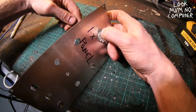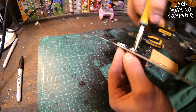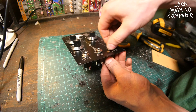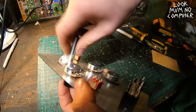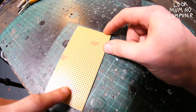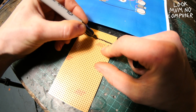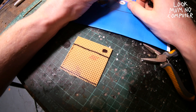Start putting the components in - maybe start by putting the valve socket in, that's a nice thing you can squeeze your valve into. Then you're tying all of the bits in and try not to scratch the panel. This is a standoff pin and it's used to hold up the stripboard, which we're going to measure right now compared to the actual picture - wise to print that out and place it on top, then Sharpie out exactly where you want the bits and figure out how many holes it's going to be, then snappity snappity.